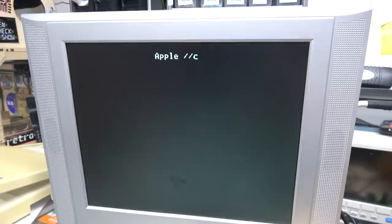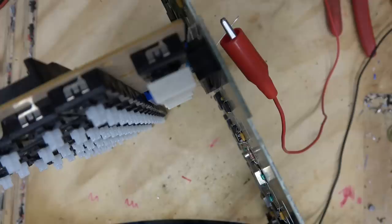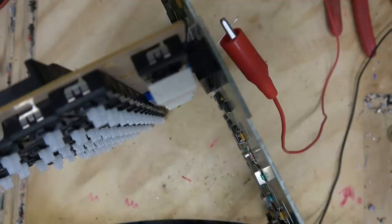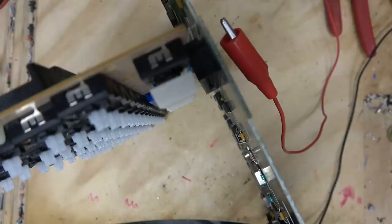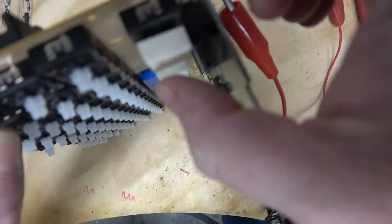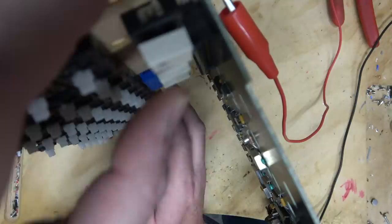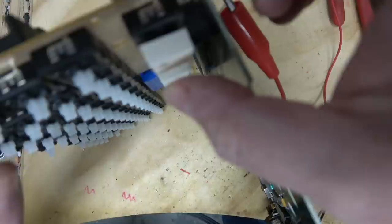It's booting! It's got a built-in demo scene. The keyboard has a reset key on it, so I thought maybe you need that to boot it up. Apple IIc - although it's not doing anything. Clearly the fault is that power brick. Control reset got me into a prompt. The keys are just going wild though. It's the world's lamest game of snake. Double-check the schematics: the keyboard controller chip needs negative 12 volts. There's your problem - that's probably why it's acting erratically.